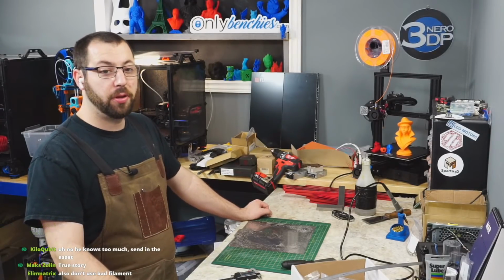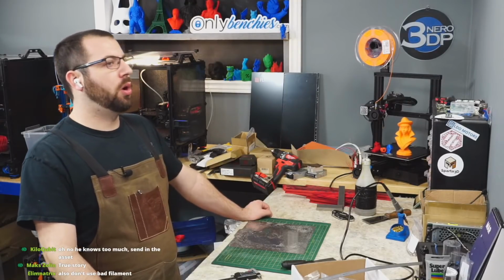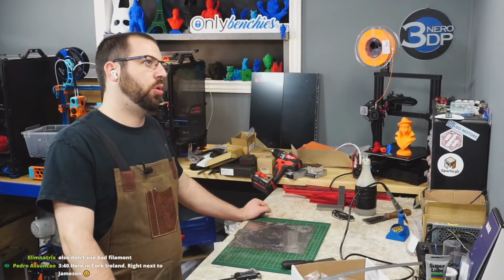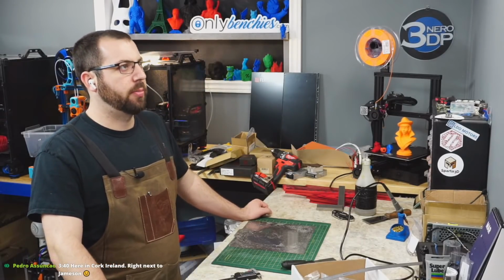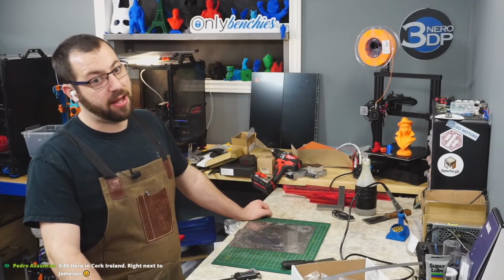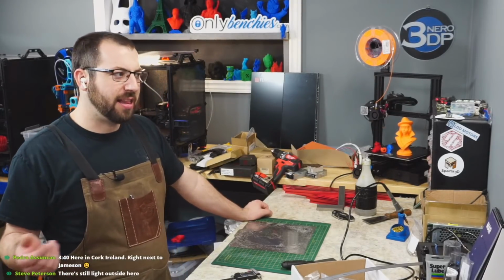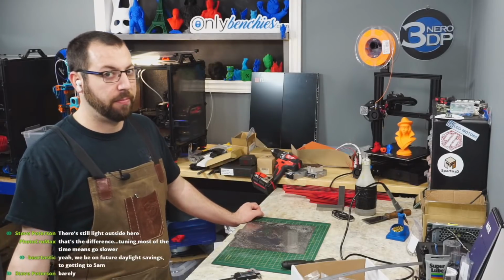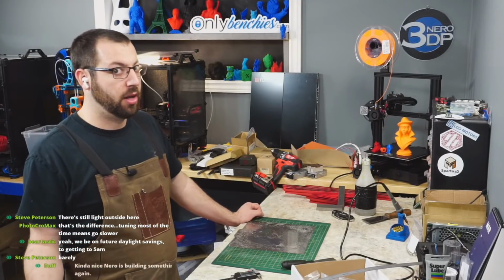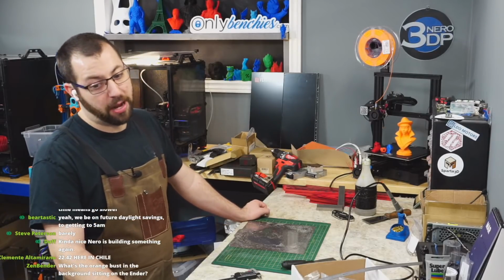Oh yeah, and also don't use bad filament. It's like ABS. Everyone's like, oh my god, ABS is hard to print. Well, what did you do? Well, I went on Amazon and I bought the cheapest spool of ABS because I didn't know I would like it. And it stinks. And it prints like garbage. Well, you bought the cheapest spool of ABS. That's why so many people think ASA is a wonderful plastic. It's because there's more good ASA filament out there than there is good ABS filament. But if you have good ABS filament, it prints fine, just like good ASA. So, that's my opinion at least.